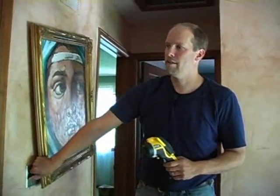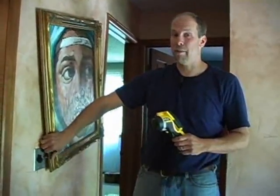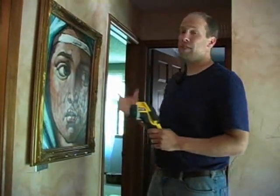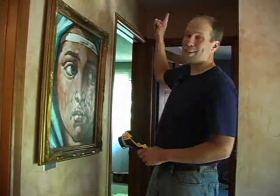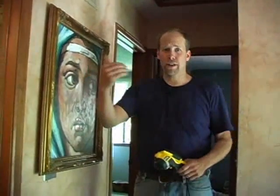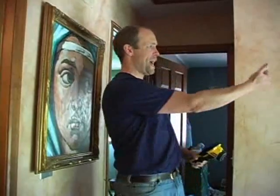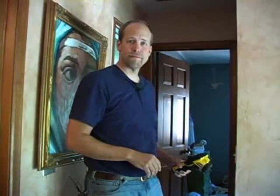It's on a timer. That's high. I'm going to leave it on high. So everything's closed up. I'm producing a low air pressure system using this exhaust fan. I'm going to let that run for about 15 minutes. I like to do it for about 15 minutes. And then that'll give us some really good airflow patterns coming from certain areas, typically around windows and doors.